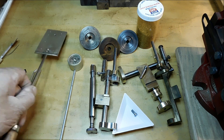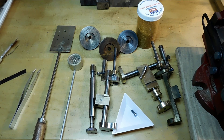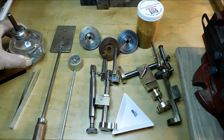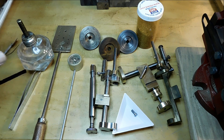When it's done, I put it in a screw plate, and using an alcohol burner I'll heat it very slowly and temper it until it gets to a nice dark blue color. And that'll all be on the next video.